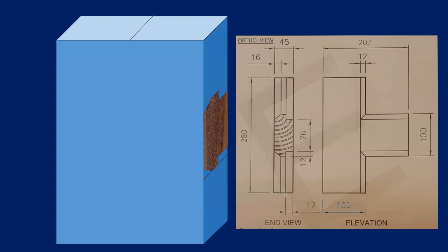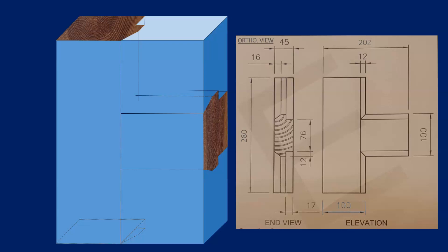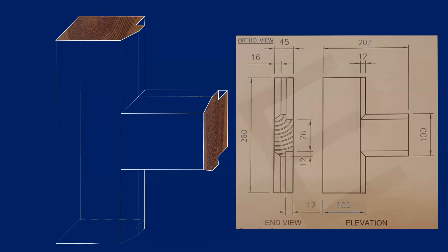In a case like this, just take the sectional views of each piece and plant them on the end of the box, the top of the box, and the bottom. Then, as illustrated, pull those lines in from those profiles. In this case you have what's basically an oblique profile taken from the orthographic drawing, and you'll see the lines pulled from those oblique profiles.